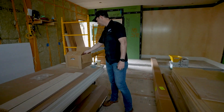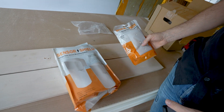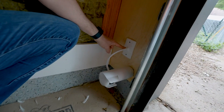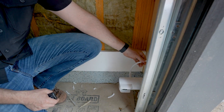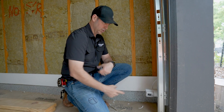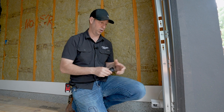I also did a couple of beauty things on this garage door. I found a fairly inexpensive system on Amazon called WireHide — about $10 to $15 — and a sensor shield for about $25. The WireHide hides that Cat5 low-voltage cable sending a signal to the safety sensor. The sensor shield is a rigid powder-coated metal piece that protects the sensor — you can get it in white or black. If you knock the sensor with your golf clubs or bike, normally your garage door won't go down until someone comes back and jiggles it to realign it. With this shield, they're protected and will stay aligned.